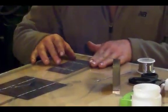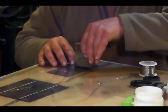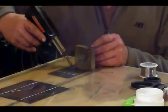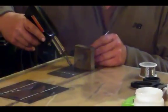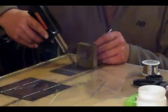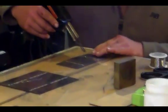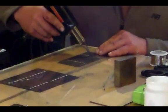At this point I take a piece of tabbing wire. I like to place it down — some people put a little bead at one end — and then I take my little jewelry block, which acts as a third hand. I've got a piece of solder, and what I'm doing here is just getting the heat to transfer so I'm not overheating the cell or the tab. Once I see the solder flow, I use a push technique. I can now lift up my block and it's kept my tab relatively very straight and in line.